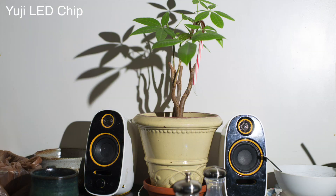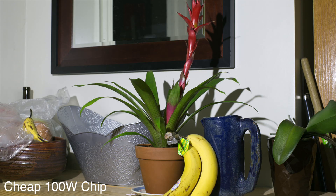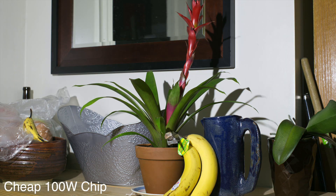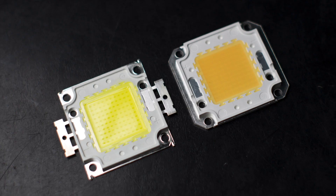The colors appear much more vibrant and accurate with the High CRI LED. The camera's white balance can correct for some of this tint, but even when it does the colors look dimmer and more muddy. The High CRI LED has a color temperature of 5600K, which is the same as daylight. The cheap LED has a cooler color temperature, but I adjusted that in camera so that you can really tell the difference in color quality. I wish I would have used a High CRI LED in my DIY film light, because it would have created much better skin tones.